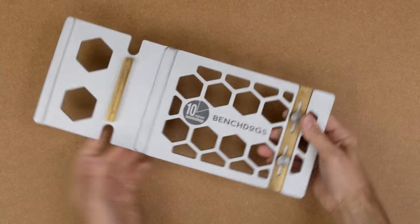Of course, you can always turn the MFT top around. You'll get a longer cross cut with the MFT in portrait mode, but that carries the risk of pushing the fence or workpiece dogs off the edge of the top, so you'd need to use the holes that are closer together, when what you really want to do is keep those reference points as far apart as possible where you can. So where does the rail square fit into all this?